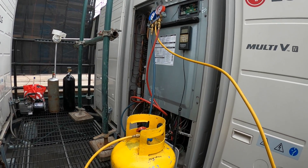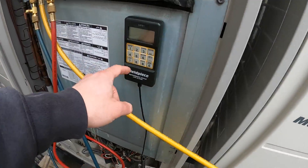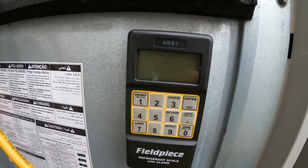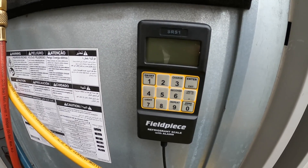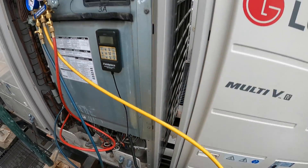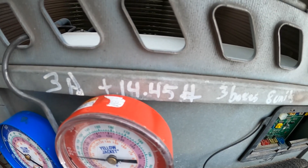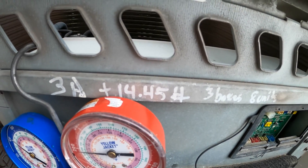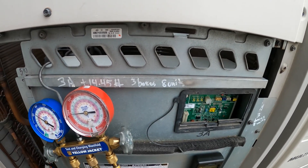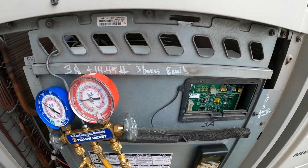In this case, you're going to want a scale. I have this tank sitting on a Field Piece scale — this is the Field Piece refrigerant scale with alarm, the SRS-1, it's pretty good. We're going to use that to see how much refrigerant we actually pull out of this machine so we have an idea. If you're lucky, you might get a trim charge record from installation to compare against. It's important to check because some of these systems come with leaks, so you can address issues and get a better understanding of what's going on.